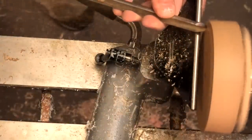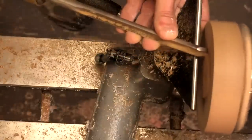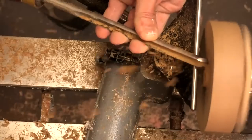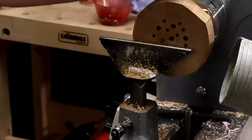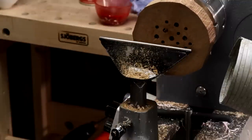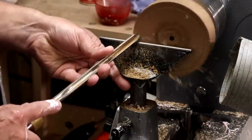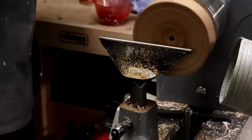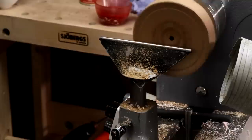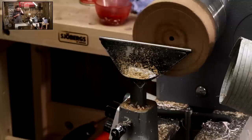Let's clean up this outside surface. I'm going to measure the bowl so I know how far we've got to go — I cut this purposely oversize. Before turning this section, I measured out to 120mm. The finished external surface of this little resin pot is 95mm, so we need to transfer that onto the surface. I'm doing it ever so slightly undersized so I don't make a mistake. And if I didn't say already, this is a piece of oak — a beautiful, very dense bit of oak.